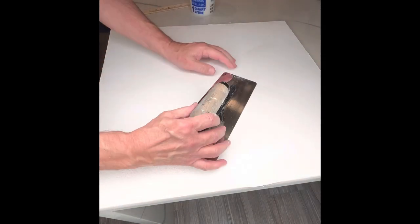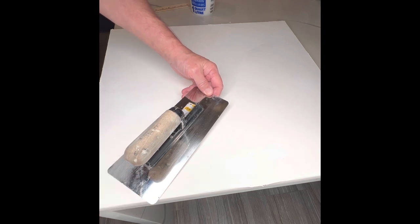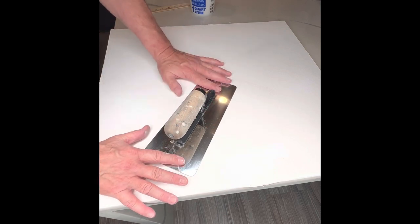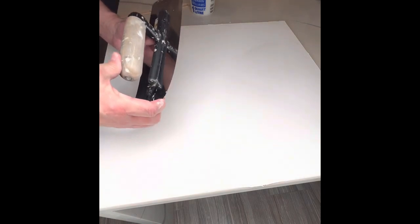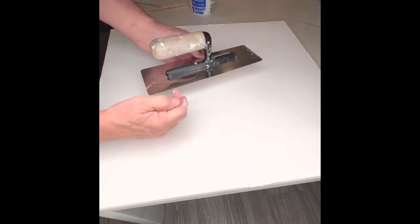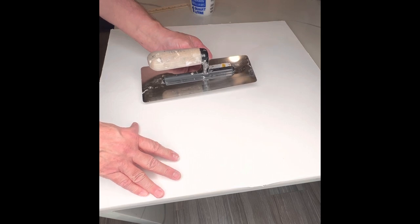We only use the combi trowel for application — we do not use any other trowel under any other circumstance. In my opinion, the combi is the most balanced, the most lightweight, and even though it's rigid it's still got flex to it — plenty of flex. This is not a flex trowel and it's got flex — that's important, that there's that much give. It's important that you have this much blade on a massive wall; if not you're going to end up with whatever kind of patterns repeating over and over again and that gets tired looking.